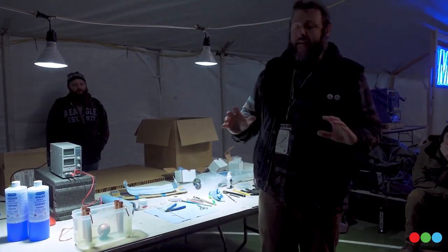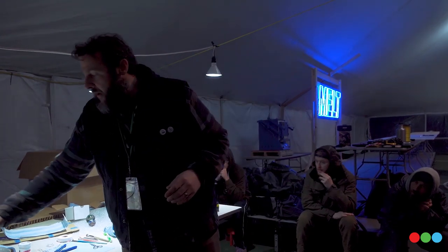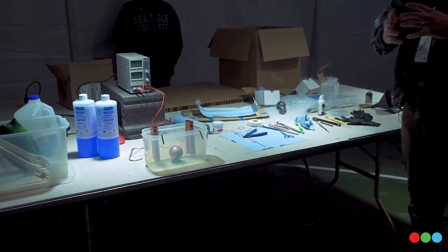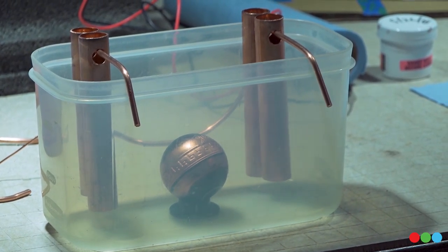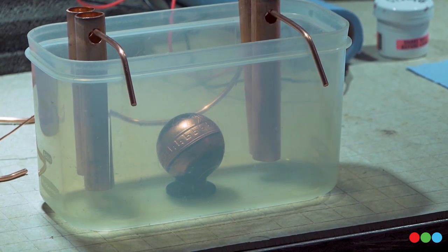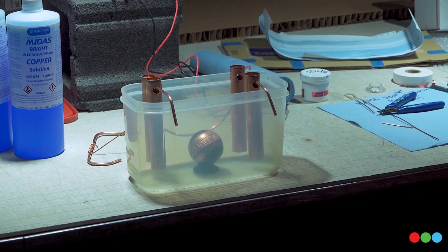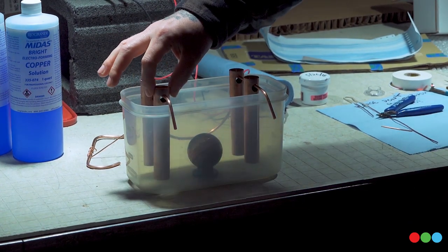The reason they say that is because if you go beyond that, like if I put three bars on each side here, you'd be by far exceeding double. I'm already exceeding double, but if I were to exceed it by far, I would never develop that coating of phosphorus. It pulls so much slower off those pipes that the phosphorus doesn't accumulate and it will foul your solution. So the sweet spot for the anode suggestion is that it will make your solution last longer, because you'll get those better coatings of the black phosphorus, slime, sludge, whatever.